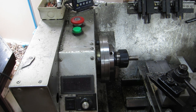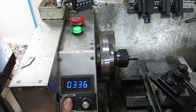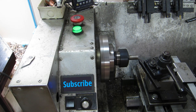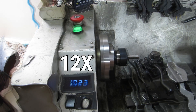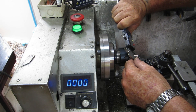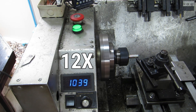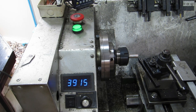I've put the collet chuck on to finish this off. I did it up as tight as I could yesterday and with a pair of multi-grips - you can see I chewed the thread up a bit - but it's coming off so it doesn't matter. It ended up a little bit wonky though. That was the idea of using the bolt so I could machine that off there. I think I'll have to get it down to 10mm - it's at 11.25mm and still has a fair bit of thread there. The battery's going flat again so I'll change it and come back to you.